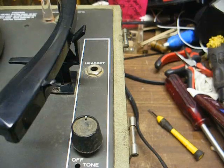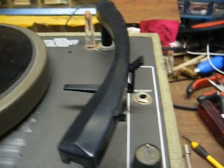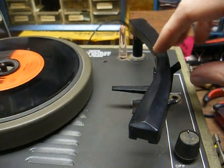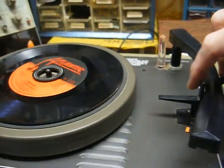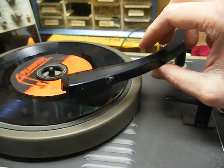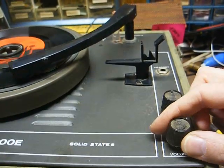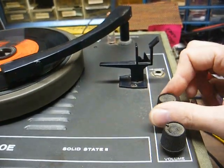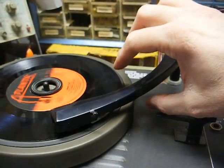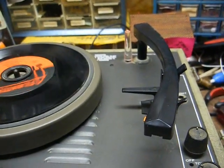With this cartridge, we have plenty enough gain. I had to turn the gain pot down a little bit, and I went back to the 33k ohm resistor on the loudness tap of the volume control. It plays nicely now. It doesn't have quite as much bass as the 89T had, but it's still very listenable and doesn't sound quite as muddy. It will play these bass-intensive records without skipping all over the place.